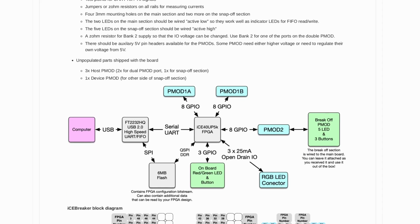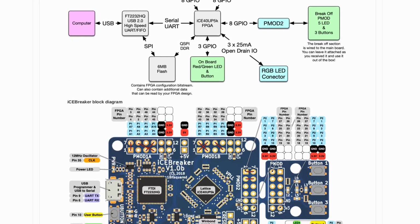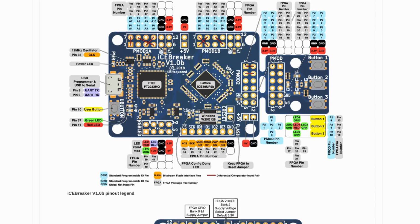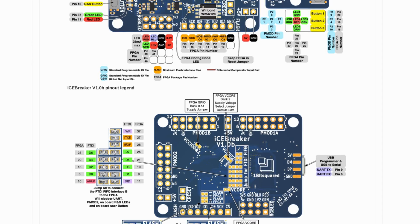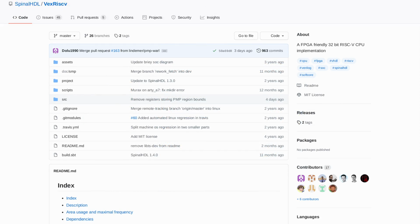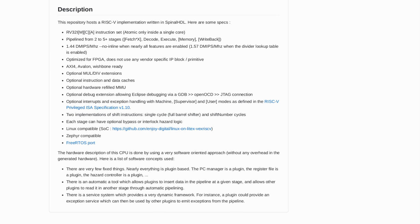The original README actually lists the minimum as a 386 CPU with 4 MB of RAM to just start the game, but recommends a 486 or better. Generally, it's considered that a 486 DX2-66 with 8 MB of RAM is pretty much what's needed to get smooth gameplay. Here we'll be using a RISC-V softcore, the VexRiscv to be precise, configured to support the RV32IM instruction set. From experience, I know I can get that to run at around 25 MHz on the UP5K.